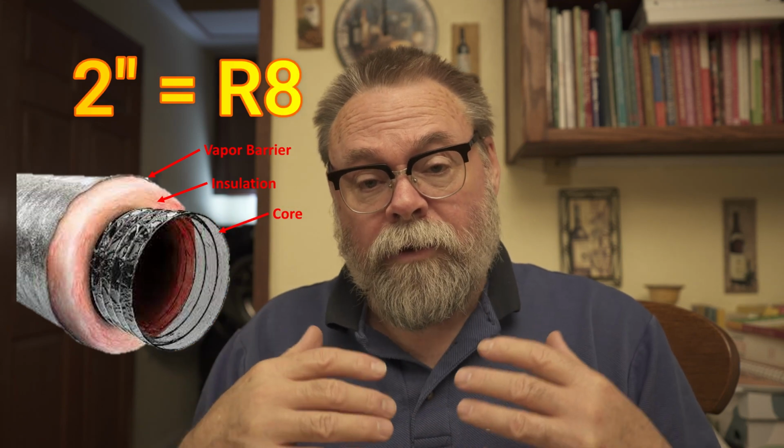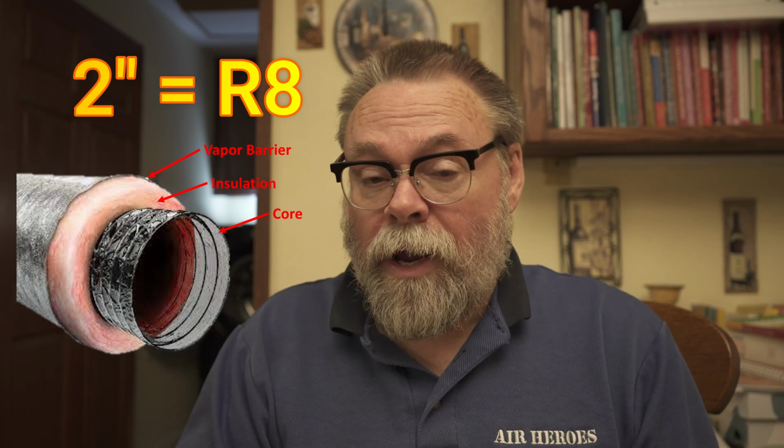We at Bailey's and Air Heroes only use R8 ductwork. Why? It has a better R value, so you get less heat loss in the wintertime in the attic and less heat gain in the summertime from the attic. So it does save on energy.